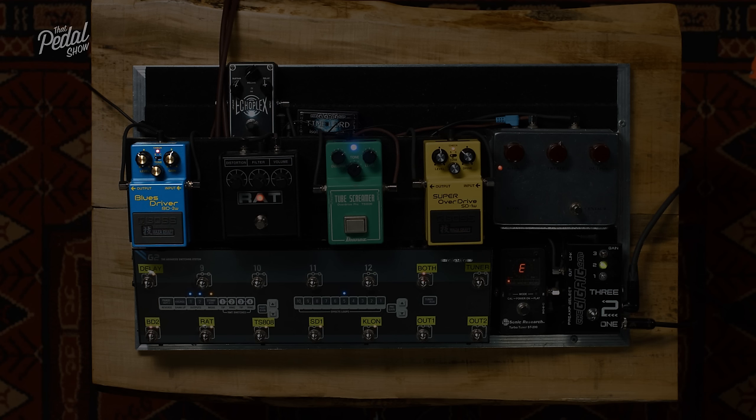I can feel it on the end of my nose. Yeah, it feels nasal to me, is where that frequency is. All right, so that's a 1K mid-hump. Let's talk about the classic Tube Screamer mid-hump. It's down from there, yeah? It's down from there. So I think it's 742 hertz, around there, 742, 750, around that area.